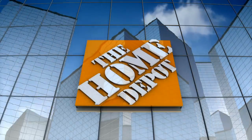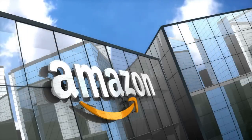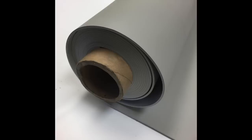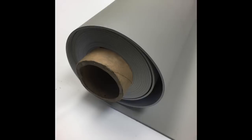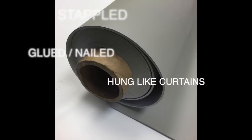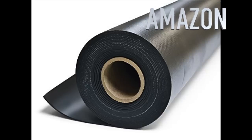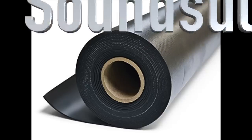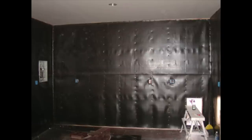Now let's talk about where to buy MLV. The simplest way is either from the Home Depot website or Amazon. The mass-loaded vinyl I recommend from Home Depot is from SoundSafe. This MLV is not self-adhesive, but that helps keep the price down compared to self-adhesive options on the market. It can be screwed, stapled, glued, nailed, or hung like a curtain using grommets. The MLV I recommend from Amazon is the SoundSlate mass-loaded vinyl. The price is very similar to the SoundSafe from Home Depot, but one difference is how it's made — SoundSlate is made from virgin material with no recycled content, and is entirely odorless. This is also a non-self-adhesive MLV. I'll have both product links in the description below.